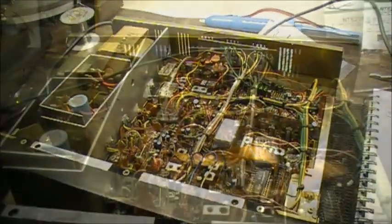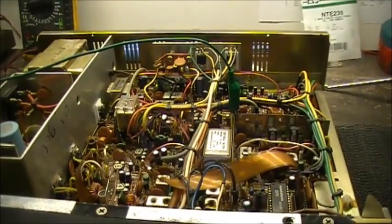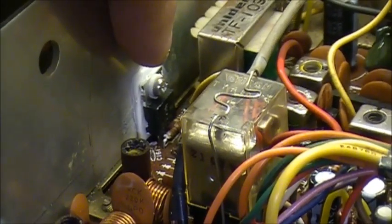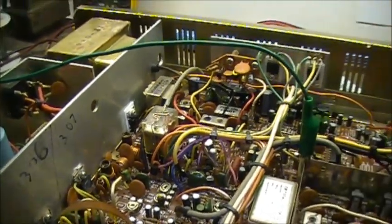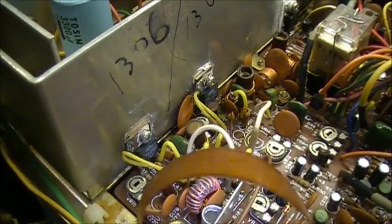Anyway, keep at it. Well, we have one 2SB235 back here that is doing no switching at all. This one is switching in transmit. This one down here is 13 volts on the center pin. The other two are not switching at all. The driver and final are not being switched any voltage.